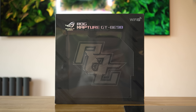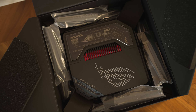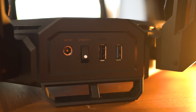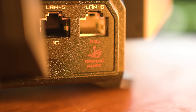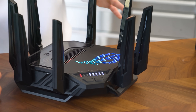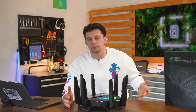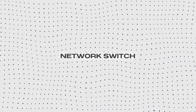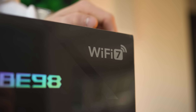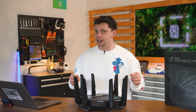If you've watched any of my networking videos in the past, you'll know I'm not a massive fan of combi devices like this. A combi device is a device that's got everything built into it, all in one — a network switch and an access point. But this one, although it's got a 10 gig switch built into it, Wi-Fi 6 and 7, I think it's big enough to warrant the space to do everything really well.